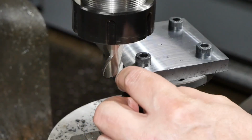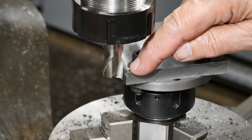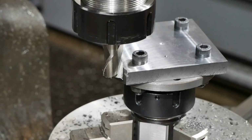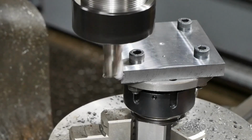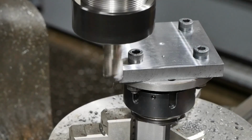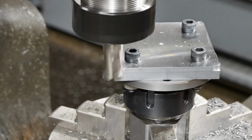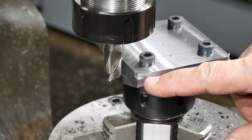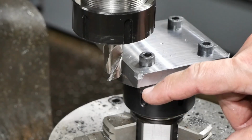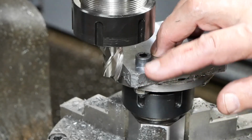That doesn't feel very good. I've reset my first cutting radius from 64 to 66 millimeters. See if it's any happier with that. Well, that seems to be working okay. I'll take the additional 2 cuts to 12 millimeters depth and then move in a bit. Well, that sort of worked, but I wasn't very comfortable with it, so I swapped the cutter out.